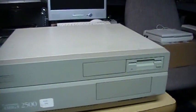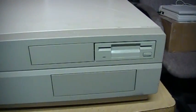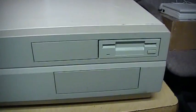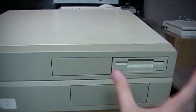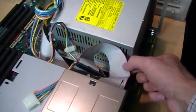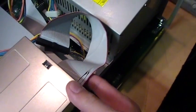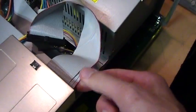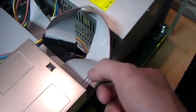There is the floppy drive installed in the case, which isn't as easy as it sounds because the screws that hold the drive cage into place don't go into holes — they go into slots. So you get a lot of adjustment in positioning, and it takes a couple tries to line it up with the case front. Another thing about Amiga floppy drives is that the pin one stripe on the cable goes on the outside, whereas on most PC floppy drives it goes on the inside.